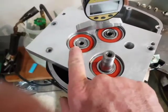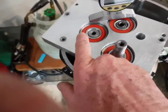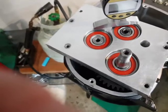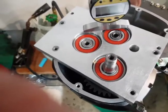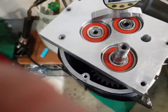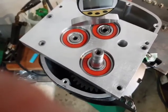In these two shafts here, there are two oil baffle plates in the other end. So when you put the shafts in, they are automatically sticking up the depth of the machining plus the amount of those baffle plates. There is another baffle plate that goes on the intermediate shaft. Those baffle plates are covers that go over little depth holes in each end of the gearbox, which fill up with oil and run oil down the shafts when the gearbox is rotating. So what you're trying to do is calculate what size shim you need on the back of each of these three bearings to set up the exact amount of end float the gearbox requires to function correctly.